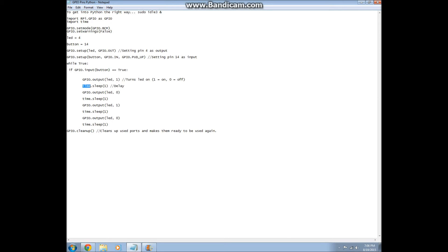This is the time library, so we need to make sure we import the time library, otherwise this wouldn't work. time.sleep — I've experimented with it and found that one second is really a good time, as you can see in the video. I've basically just copied and pasted it a couple of times, so it's going to blink twice: on, wait one second, off, wait a second, on, wait a second, and then off again. Then GPIO cleanup basically cleans up your pins, and that's what you want to do at the end of every program that uses GPIO pins — clean it up so it's ready for the next time.